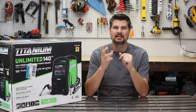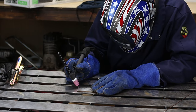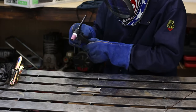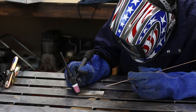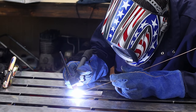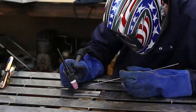The TIG function — keep in mind you're going to need 100% argon and some tungsten. These are just the basic TIG welding setups in that they have manual valves, so you do have to turn on the valve. There's a shot of what it looks like if you forget to turn on the valve. This is a lift-style TIG, meaning you actually touch the tungsten to the workpiece, and when you lift off, that's when it creates the arc. It's kind of a step up from scratch start, but not as nice as a high-frequency start.